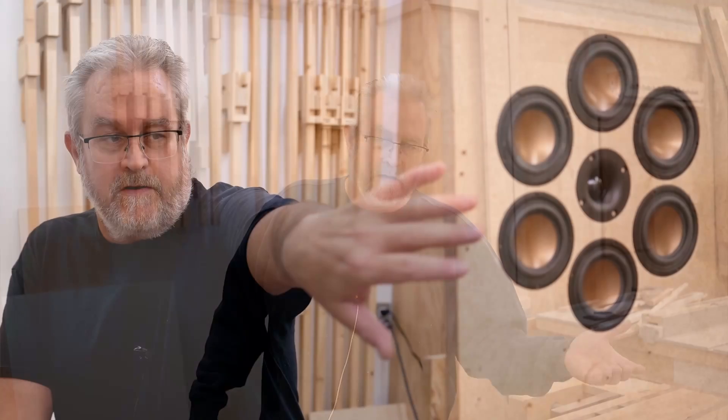To talk briefly about the design: it is a continuation of the mock-up that I built a few months ago, something I'm calling a coax array. If you don't know what a coax is, it's a two-speaker arrangement. In this case, it's a six mid-range ring around a central tweeter. The tweeter is horn-loaded, so it's fairly high efficiency. The mid-ranges themselves are not very efficient, but six of them together will get it up closer to the tweeter.